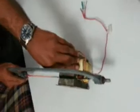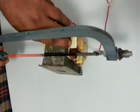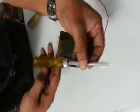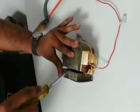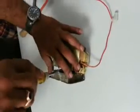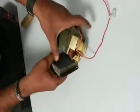Using a hacksaw, cut the welded portion to a depth of approximately 2 millimeters. After that, using a flat tip screwdriver as a mini pry bar, splice it in between and you'll be able to remove the I portion from the E portion. Be careful not to get yourself hurt or bruised.